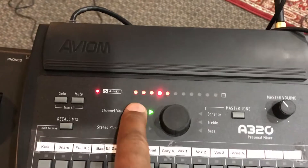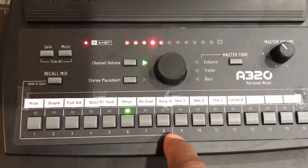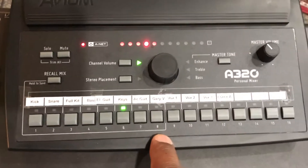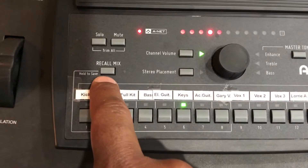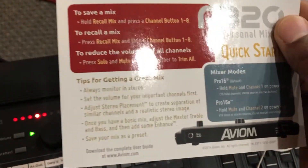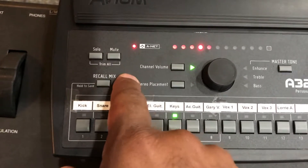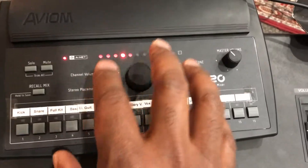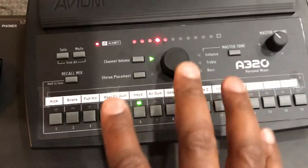The other awesome thing is you have the ability to save your monitor mix. We have channels one through eight that are designed for saving your individual monitor mix. Once you've done a Sunday or two and you've got things sounding exactly the way you want, all you have to do is come over to the recall button. To save a mix, hold Recall Mix and then press a channel number. So if I want to save mine in channel five, I hold the button and click five — that monitor mix is saved. Next time I come in, I press recall five and my settings are back.